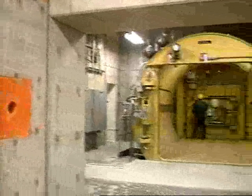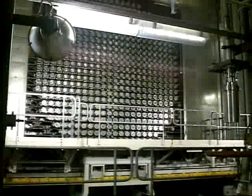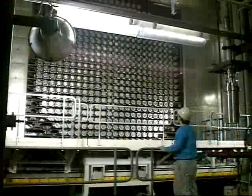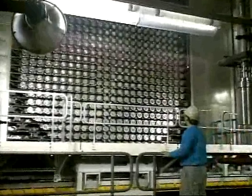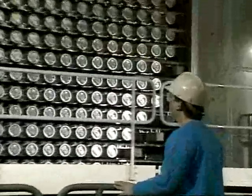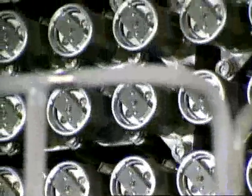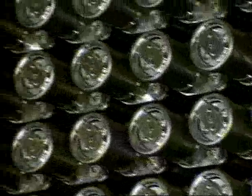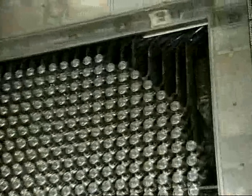The reactor itself is hidden behind two meters of concrete. After you pass that barrier, there's an elaborate airlock system. This is the face of the reactor itself — the round things are the fuel bundle tubes. I'm not in any danger here because the reactor hasn't been operated yet and there's no radioactivity. After the reactor is operated, people won't be in this room except in protective suits and for a very short time. Each fuel bundle will remain in the reactor for about 15 months, and the reactor is refueled while it's still operating by a robotic fueling machine. At the top of the tubes, you can see the plumbing that carries the heat transfer water to and from the tubes.